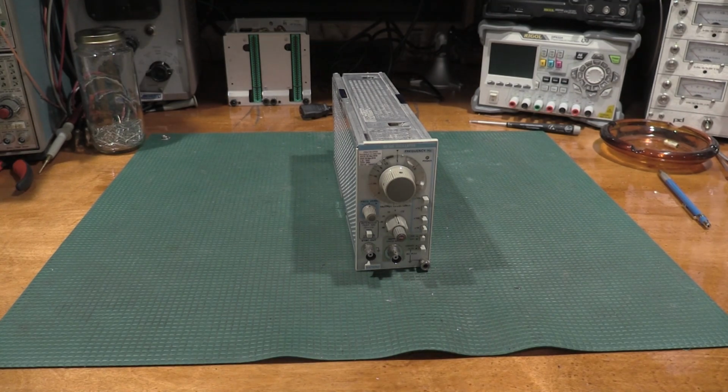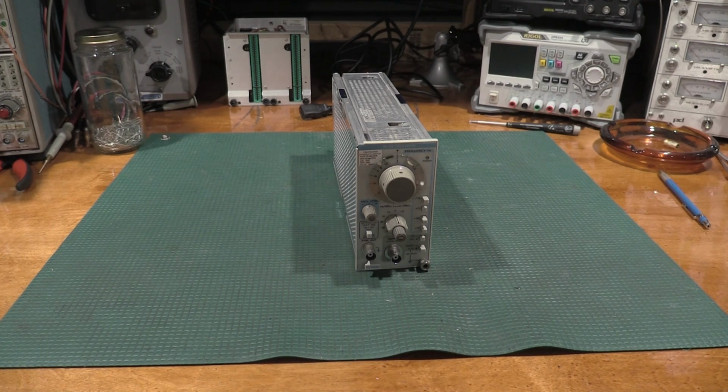I have not rebuilt the power supply on this, and one of the things that I want to do in this video is, because I have the QA403, I want to do a distortion measurement before and after the power supply rebuild. Some of the capacitors in the power supply for an SG505 are pretty large, physically and value-wise. One of the reasons for that is to get the power supply as quiet as possible, given the space constraints of the unit. The SG505 is a pretty standard oscillator. The magic that makes this what it is is the monitoring FET and the op amps that go into making it go. So we'll take a look at that when I pull the side panel off, and we will get into it in a little bit more detail.